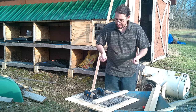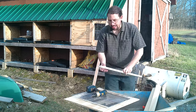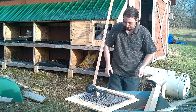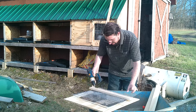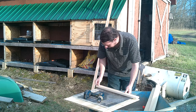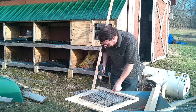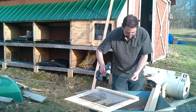Minor splice here — sorry about that. I screwed the first one in and it was splitting out the boards, so I popped a couple of pilot holes and grabbed some longer screws. We'll tack it in with these longer screws temporarily, then take them out in the finished product. I drilled some big oversized pilot holes here to make sure it doesn't split.